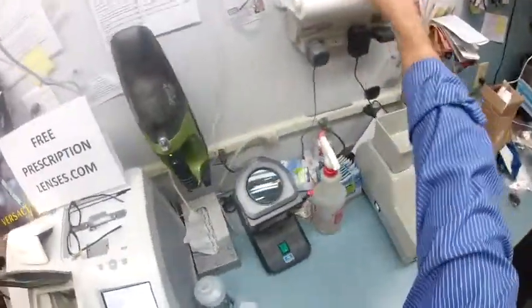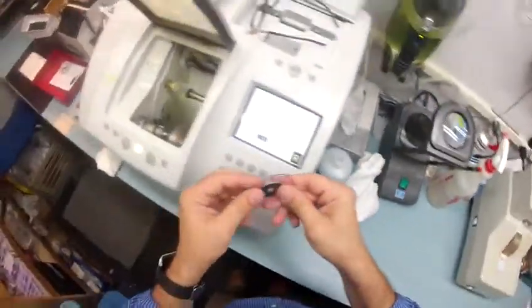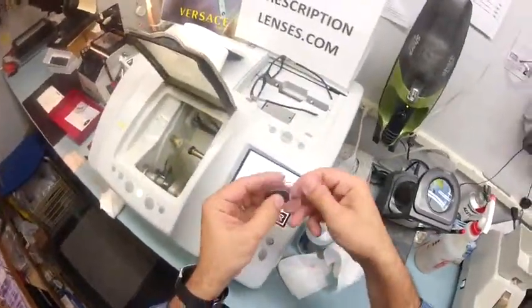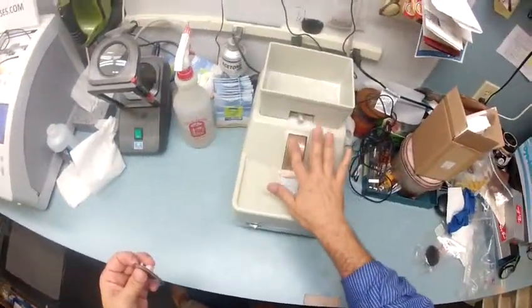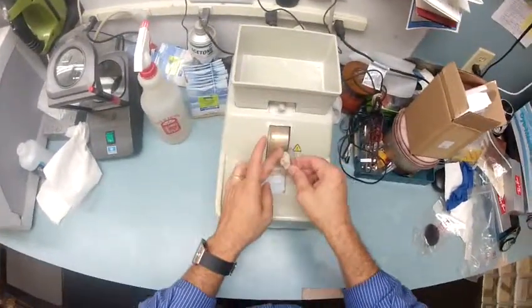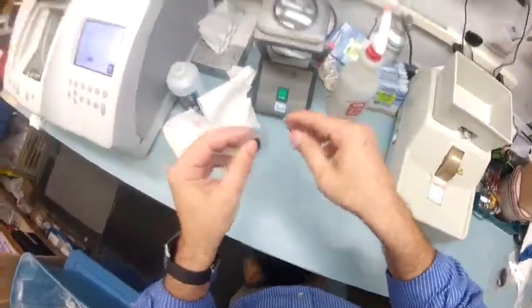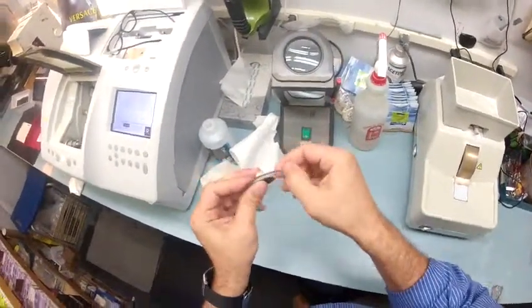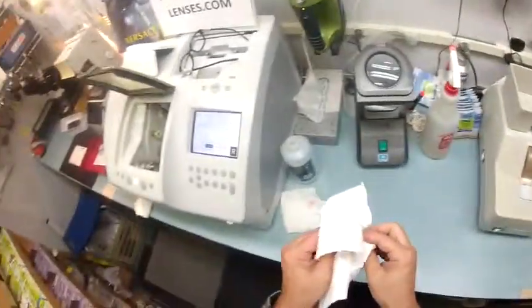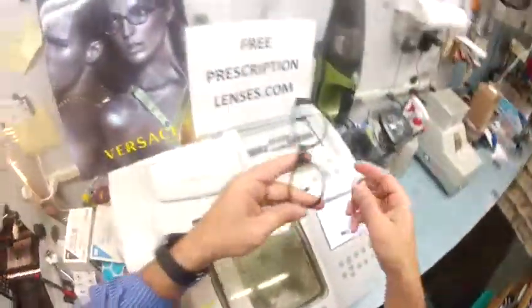I'm going to take your lens out — I want to dry it off so it's not slippery. It's embarrassing when I drop a lens; it happens one out of every million, but it's not going to happen here because I dried it off. Before I try and mount it, you still have a little bit of rough edge, so I want to use my hand stone, which is completely flat. I put my finger on it while it's running and my finger gets a little warm from the friction, but that friction allows me to apply what's known as the safety bevel. I've gone all around the edge of your lens. You see this white powdery substance — I scrape it off with my thumbnail. That is called swarf. I carefully collect it on the counter and then wipe it on the floor. In all my videos I say: kids, stay in school — I went to school for years to learn how to make a mess like that.